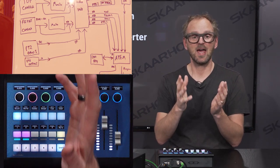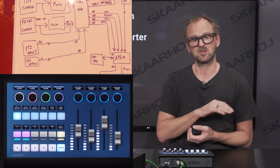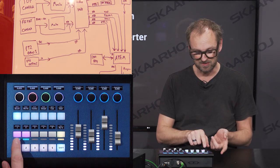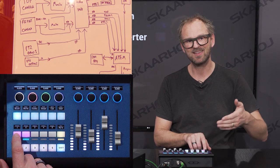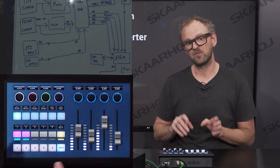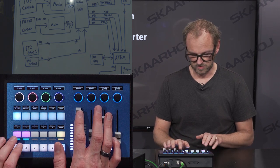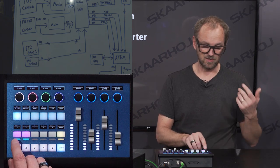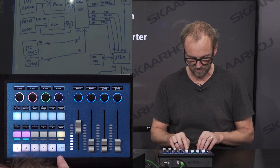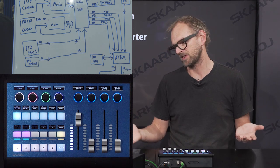I would advise that you have a reset all button, because when you start up your controller you want to send information to the camera to clear all the parameters. I actually do know one way we can do this, and that is by using the settings. The settings keep stored values of the camera, so when I press this one, you'll see we reset the camera to the value stored in that settings bank. We can now go from here — we just need to wait for this one to stop blinking, which is a way you can still revert or undo your settings. So we are now at camera one, and I have reset the parameters.